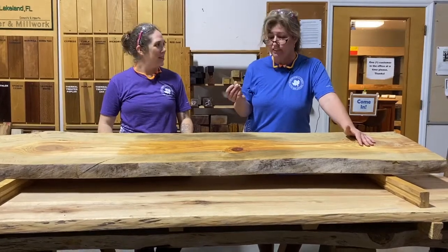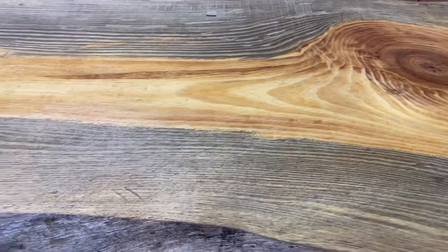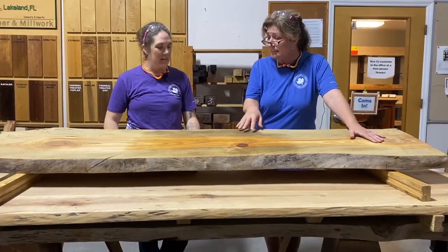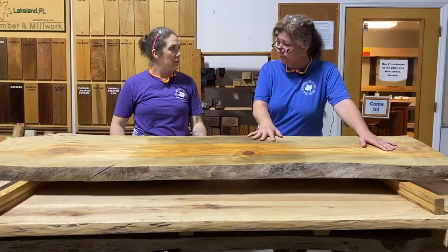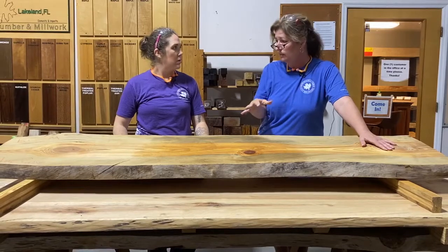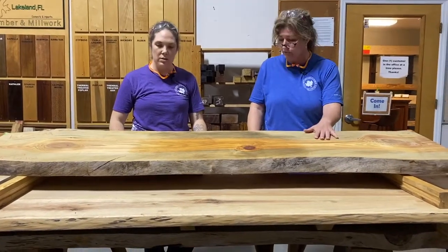It's really a way to turn something negative — an unfortunate thing happening naturally in the environment — and turn it into something beautiful and useful. I've even seen jewelry done with beetle kill. It gets such a unique color, sort of a gray-blue, and sometimes it gets really strong in color. Pine itself has a Janka hardness rating of around 870 to the low 900s — not the hardest wood, not the softest. It's pretty versatile. You do see some expansion and contraction with it, but it's a fairly stable wood especially if it's gone through a good kiln-dry process.